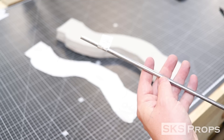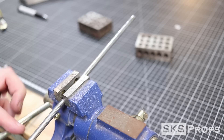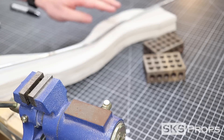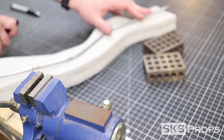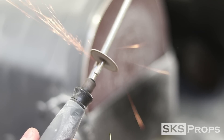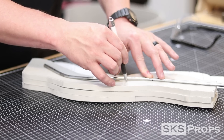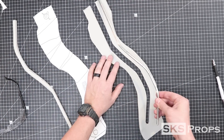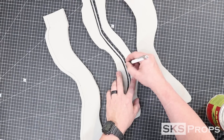I decided to use a quarter inch metal rod to give the handle a little more stability. This metal rod was bent to shape using my bench vise and a little bit of elbow grease. I continued to check for fit against the foam handle and then marked with a permanent marker where the next angle would need to bend. Once the curves were correct, I used a cutting wheel and my disc sander to cut off and round over the round bar. I take the bar back to the workbench and trace it onto the middle layer of the handle. This section is then cut out, and you can see how the bar will be sandwiched in between all the layers.